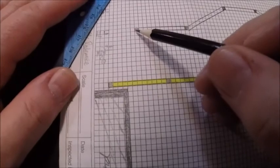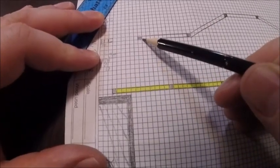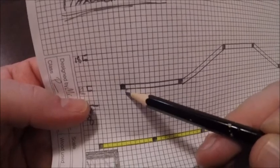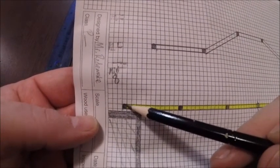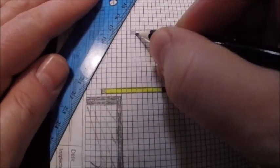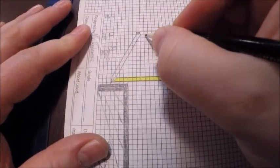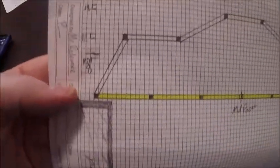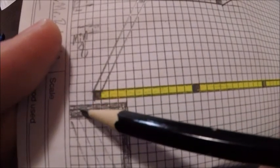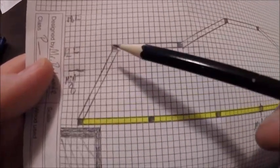Now again, I'm going to go to the inside edges here now. This is important. I'm not going on the end here. I'm going on the inside of it. So I'm going to connect this bottom corner. So the bottom right corner of this connector right here to the top right corner of this connector. So top right to bottom right, top left corner to bottom left corner. So right corner to right corner, left corner to left corner. It's really important that this part goes under this beam, not to the outside. So you can see on this beam, it goes to the bottom here and it sits on the top here. It does not go through it. It's not going clear back here or cutting through. It sits on top between. These are solid wood. You cannot have wood go through wood like that. Okay, so it's in between.